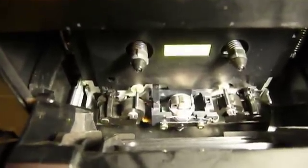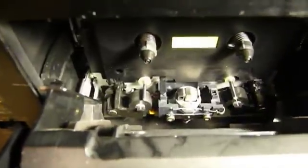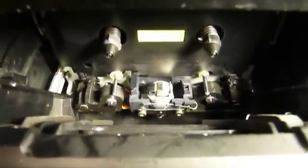When you're done with the pinch rollers and the capstan drives, and it may take a fair amount of scrubbing before you reach that point where you're ready to move on, but when you are ready to move on, it's time to go after the heads.